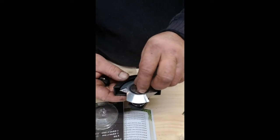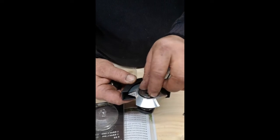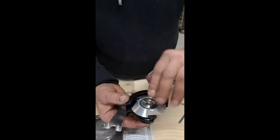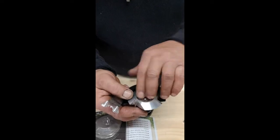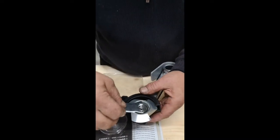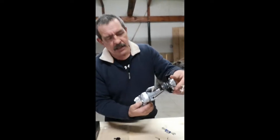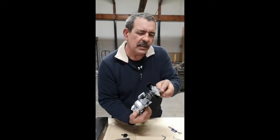You want to put this locking nut on with the chamfer down so it has full alignment on the shaft. If you put it the other way, as long as it's tight it probably wouldn't be a problem, but this gives it double the amount of shoulder to work off of. You can probably spin this in most of the way just with your fingers, then use your wrench — spin it until it locks.